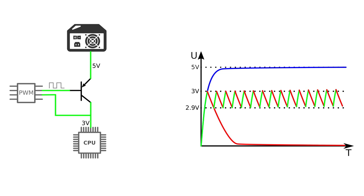However, switching voltage regulators do also have an important drawback. They generate not a steady voltage like linear voltage regulators do, but such a jigsaw pattern. To work around this effect a little bit, usually a big capacitor is added to the circuit, which acts as a low-pass filter and flattens the jigsaw character of the output. Again, this is a very inaccurate representation, and in reality it is usually not as perfect as the pink line shown here, but you hopefully get the idea. In reality, this line is still not as stable as it sometimes needs to be. That's why switching voltage regulators are rarely used in high-end audio equipment.